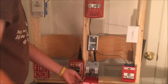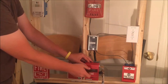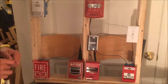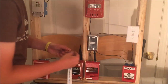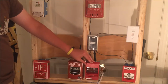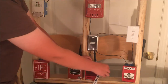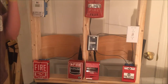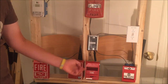Once you've turned off the switch, you have to go back to the front face to close, lock it back up, and reset it there. You lift the front flap, push the bottom, and close the top — then close the whole pull station. It gets stuck if you just do the key step, so you have to go in and reset the switch, bring it back up, open the top, close the bottom, close the top, then close and lock. It's a hassle to reset, but I still think it's a really cool looking pull station — I really like the added step of having to open it to get into everything.